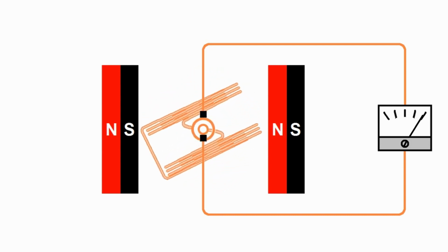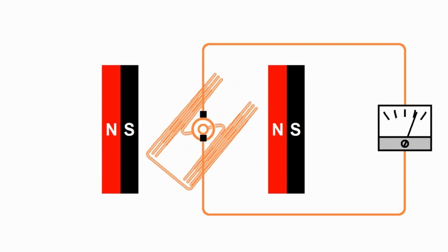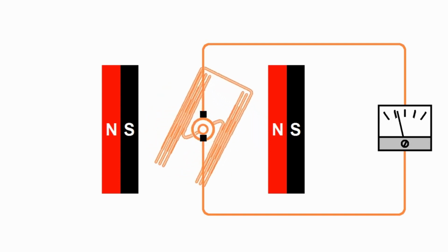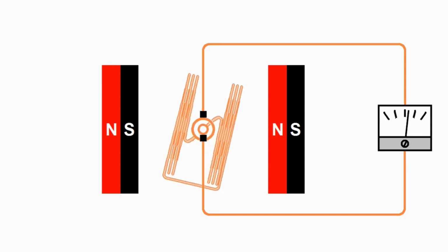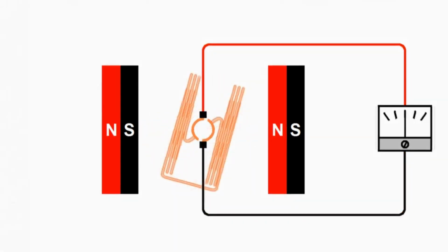So this is a basic schematic of an alternating current generator, showing once again that as it rotates through one half of its cycle, we get current flowing one way, and as it rotates through the other half of its cycle, we get current flowing the other way. So now we have basically the same idea, but now I've put the commutator back. So I've made this into a motor again. This will work just like the other one, except it's more compact and a more realistic configuration. And now we have the commutator again.